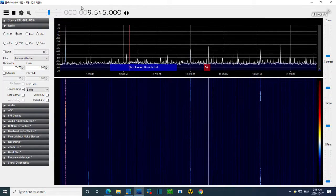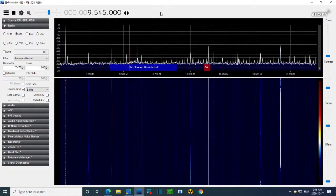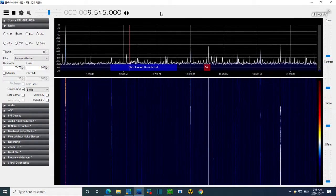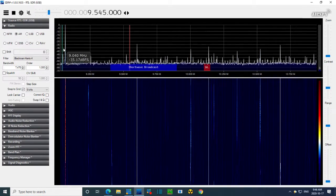So this is starting to suggest that the IF is misaligned. I don't think it is. That's the 9600. Well, this is just telling me the IF is not aligned properly. I don't think there's any other way for this to happen. And why are signals getting stronger and weaker? I'm just standing here looking at them. And what is this huge signal down here? What the heck is this thing down here?